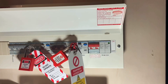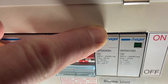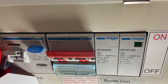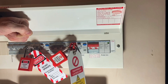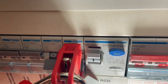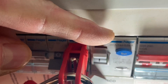I'm just going to show you this consumer unit. We've seen these before — these are the Hager ones and we like some of the key features in them. We've got the SPD, the surge unit here. We've got a 100 amp double pole linked main switch. We can clearly see that some circuits are being worked on in this installation — they've been safely isolated and locked off, which is fantastic to see. The RCCBs for the Hager boards are all A type, so you can see the little A type symbol as well as being rated at 100 amps.